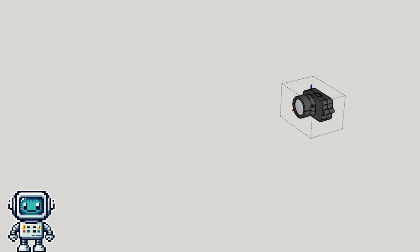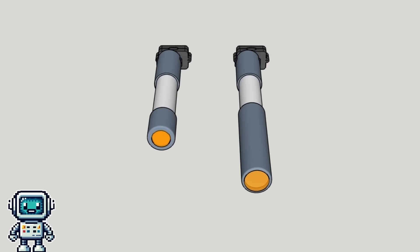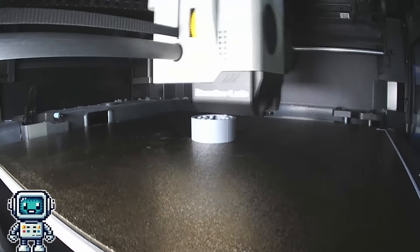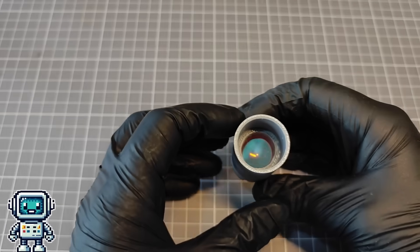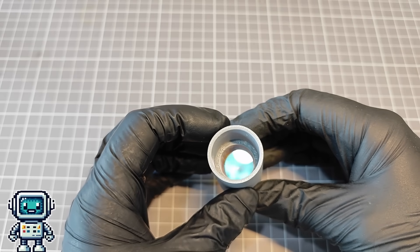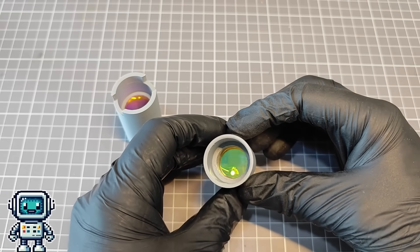This is a very simple design — it is based around a 1 inch diameter PVC water pipe, with 3D printed lens holders, and that microscope enclosure we created in an earlier video. And then it was a simple matter of 3D printing out the design. These days it is just too easy to forget how things were done before the advent of low cost, consumer level 3D printers being so ubiquitous. The eyepiece lens is friction fitted in place — we want to be sure that we can return this to the microscope when it is needed. This part also holds the camera and the other lenses to the assembly. The next part is the shorter focal length option objective lens holder — again the lens has been friction fitted into place.